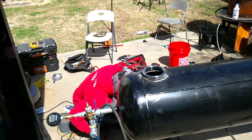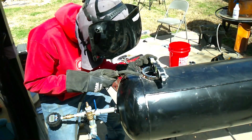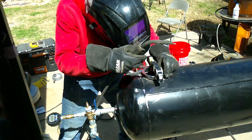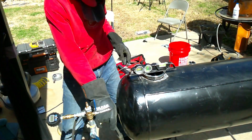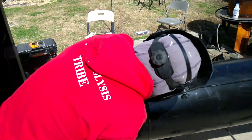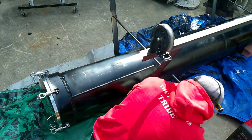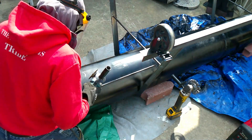It's very important to make this level because this is the foundation of where we load in plastic. If it's leaning or anything like that, the plastic may not fall down in there straight. So I definitely took my time with all of these inlet and outlet pipes to make sure they were absolutely level for that exact reason, both ways.